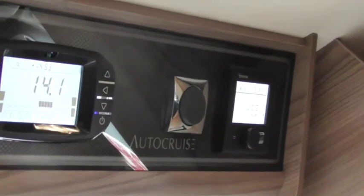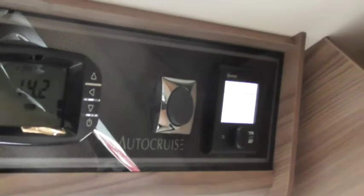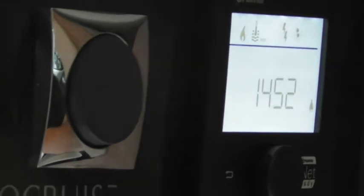So in the centre of the screen, showing clock and temperature set. Little plug there. That's to say we've got electric connected, not operating on, but connected on your consumer unit, which I'll show you later. There's an orange button on there that says water heating, or heating and hot water. If that master switch is not on, the little plug will not be there, and you won't be operating on electric.